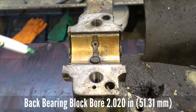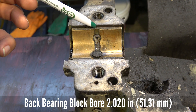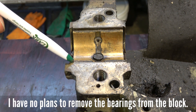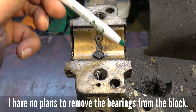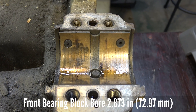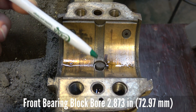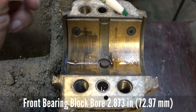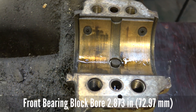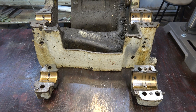Mike, for your reference, the measurements that I sent to you — measured across from here to here — did vary depending on where I was on these measurements. This is the rear bearing. Same thing on the front bearing here — measured from here to here, and depending on where, got you pretty well on average on that. So that's just a quick video on the bearings and the headstock.